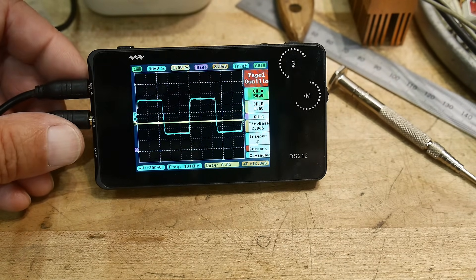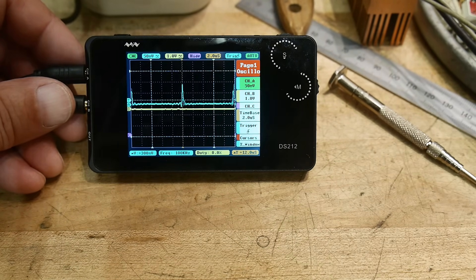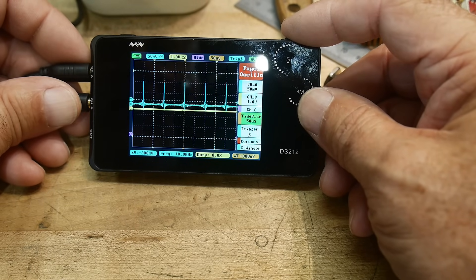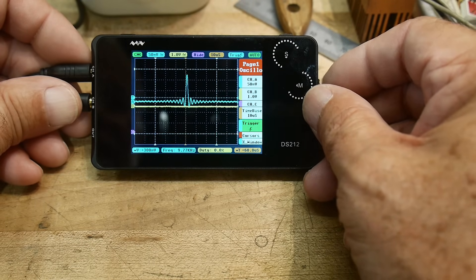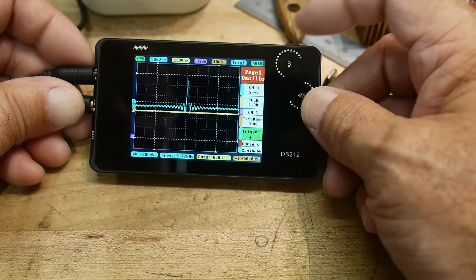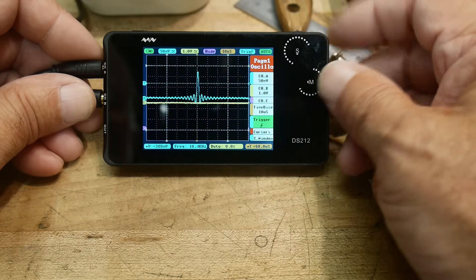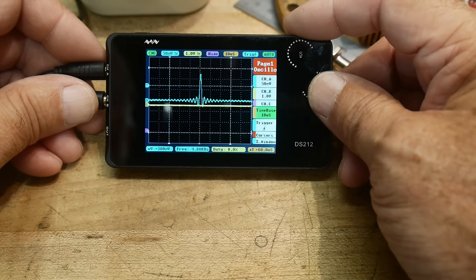Let's try other waveforms - make sure I didn't screw everything else up. Let me change the frequency to 10 kilohertz, go to the time base, and there are my little sync pulses. They're pulsing up and down because of the way these things work. Let me set the trigger a little different - set it up high. Trigger threshold - there we go, I can move it way up there. That's better. All of these little scopes have this problem. Yeah, that looks pretty good.